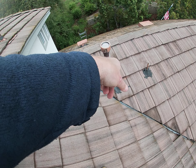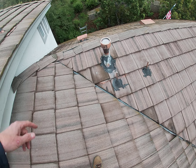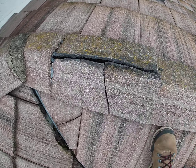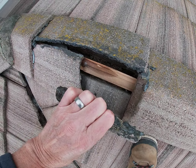These flashings — I think those were electrical conduit for something — coated in mastic. You've got a cracked tile here, that cracked ridge right here, which looks like somebody tried to fix it, but see, that's going right down into the wood.